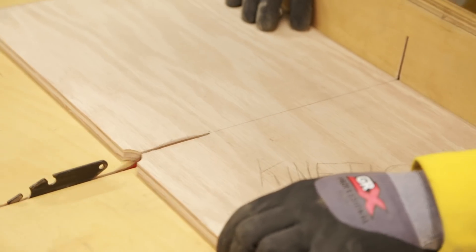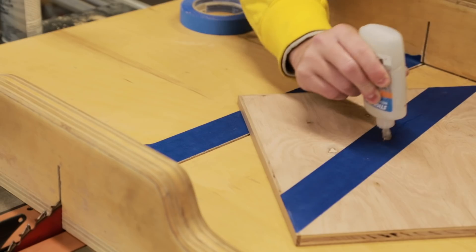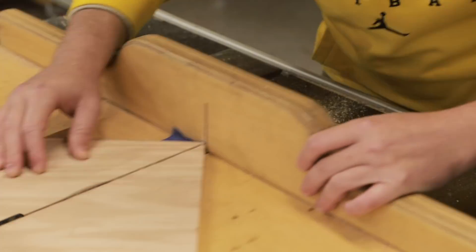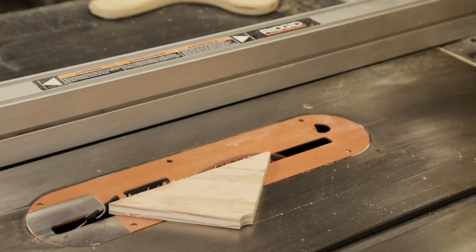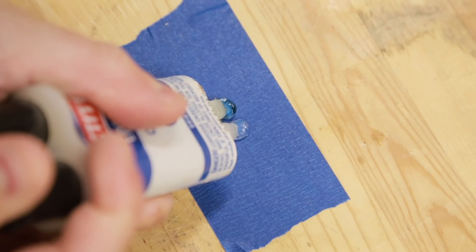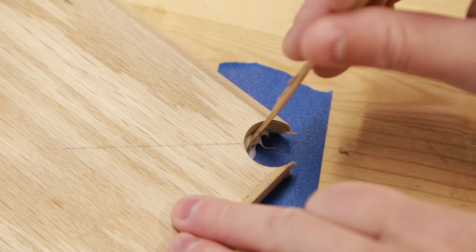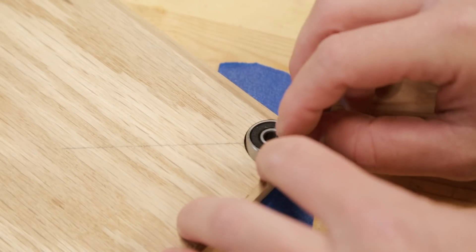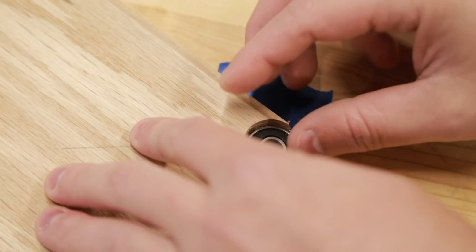I can start cutting the squares apart into the necessary pieces. Using painter's tape and CA glue, I lined up the piece on my crosscut sled with the help of a square to make the large triangle. Since I need parallel angles for the trapezoid, I can just use my table saw fence for this cut. With the large triangles, I drilled in the corners for the top and bottom bearing and secured the bearing using some five-minute epoxy. Make sure you have some good epoxy — I used some old stuff and the bearing ended up cracking off after some pressure. Once I used brand new epoxy, they held much stronger. The middle one is still fragile, so be careful with that.